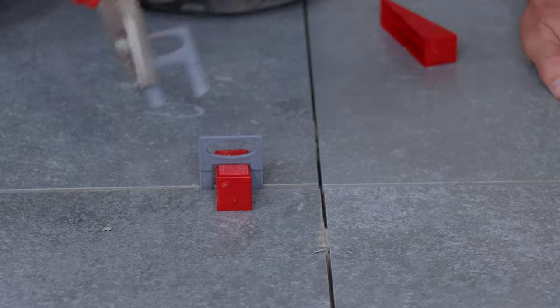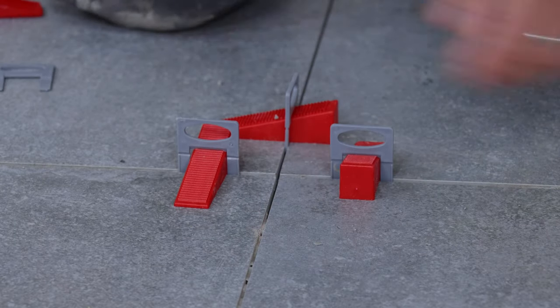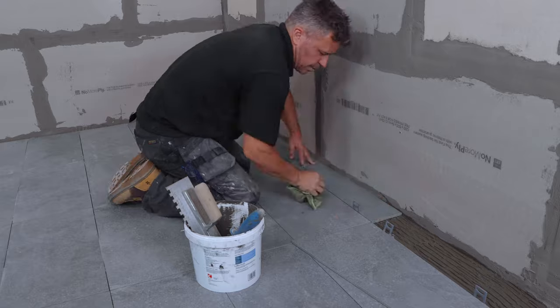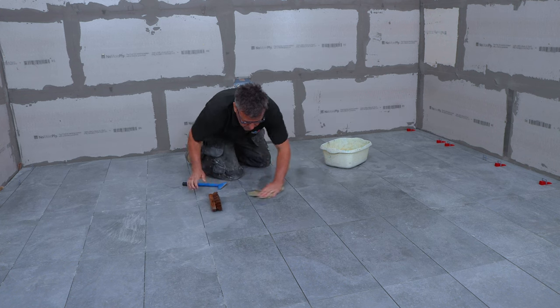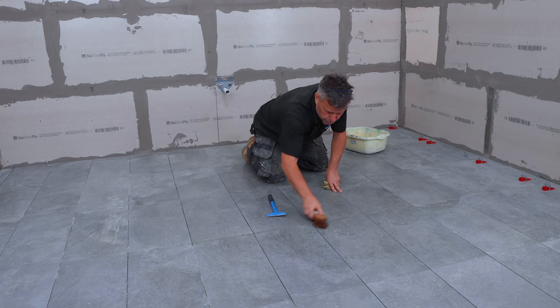Now if you have any base clips and wedges still installed in the dry tiles you can pull these out using a pair of pliers. If you take these out carefully you'll be able to reuse the wedges — then you'll only have to buy some base clips for your next tiling project. So that's all the wedges and spacers now removed. I'm going to give the floor a quick clean up, seal it, and then it's ready to start grouting. I've left my tiles overnight to dry, and then I did my cuts either side so they'll be dry in a couple of hours with the rapid set adhesive. I'm just starting to clean the surfaces of the tiles now — of course I was wiping the wet adhesive off as I went, but once you've pulled all your spacers out you often see the odd little spot of tile adhesive. Get yourself a scraper, scrape it up, a little scrubbing brush, scrub the tile down and then wipe it, rinse it and leave it to dry.